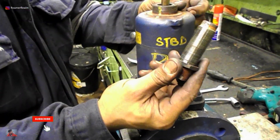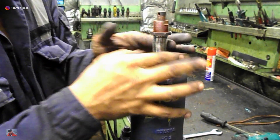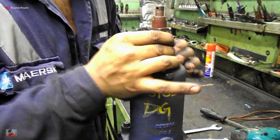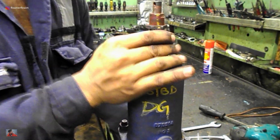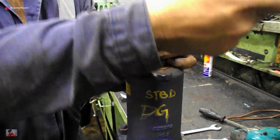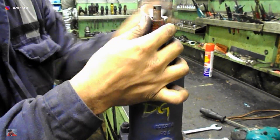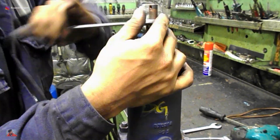Next is the spring tensioner or the spring adjuster. As the name suggests, this regulates the tension in the spring, and this step is also like the setting of the safety valve. As we already know this is not a new safety valve — looking at the marks, color and rust, it's easy to identify which part was exposed and which part of the spring tensioner was inside the valve bonnet.